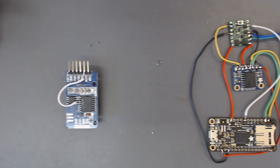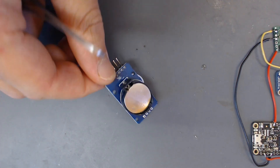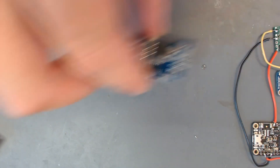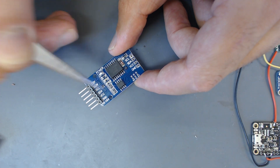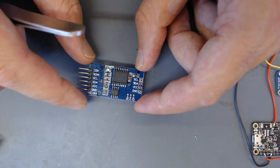We can modify it in different ways. For instance, cutting the third pin of the RTC module and directly using it as the SQW signal — don't forget to also cut the path connecting to the output pin — or maybe even easier, cut the trace to the resistor. Alternatively, you can always use the RTC chip directly, attaching pull-up resistors to the I2C pins.